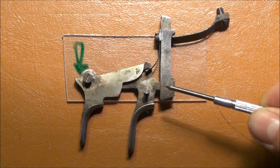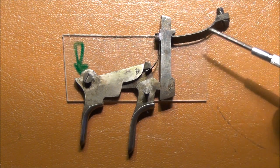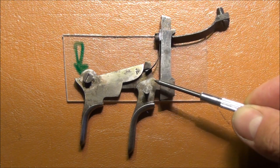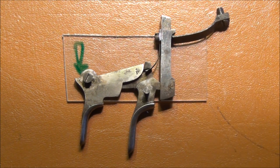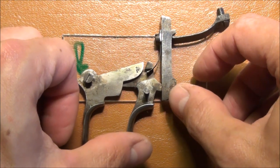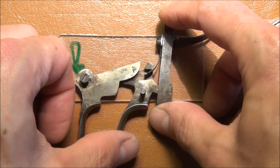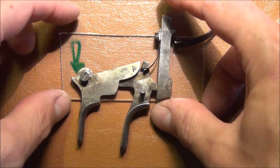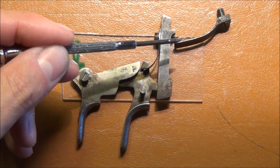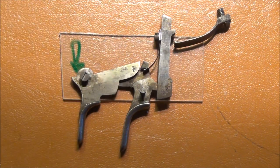I have dismembered the assembly and reassembled it using the mighty power of Perspex. Here everything is pretty much in its place as it would be on the tang assembly of the receiver. This big pushing spring here would normally be encircling the whole thing, which is why you can't see anything when it's in the tang. We'll take this away and bear in mind that this tip here is constantly putting an enormous force on this ridge. At the front we have a sear bar, maintained in its upward position with this leaf spring screwed to the underside of the receiver. On the back, this small leaf spring is basically the reset spring for the front trigger. In this unset position, you get a standard trigger pull just from pushing the front trigger; the rear trigger does nothing, and this pivots and pulls the sear bar straight down.